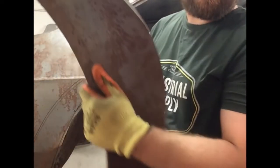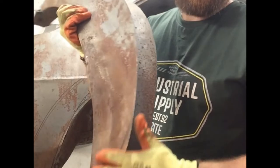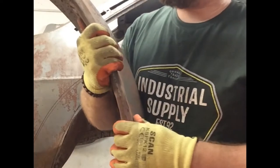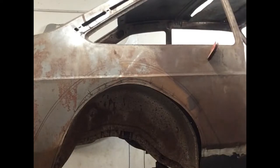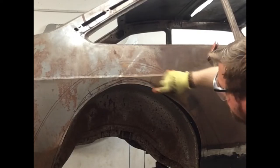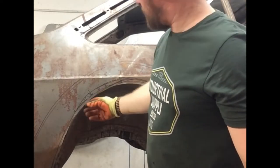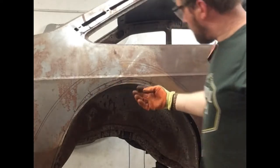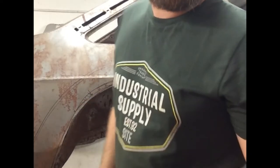The arch is out - it was terrible, the arch was bent. It was a nice piece of steel, 35 years old. Anyway it's out and here we have a nice contour. My guesstimate wasn't too far off - it's just a little bit flat here, and just fractionally smaller than the wheel arch itself, which gives me the 10mm to bend out. I used the air nibbler for the 1mm cut - went straight through, nice cut all the way around, didn't put any heat into the panel, didn't distort it. Now we just got to bend it out.